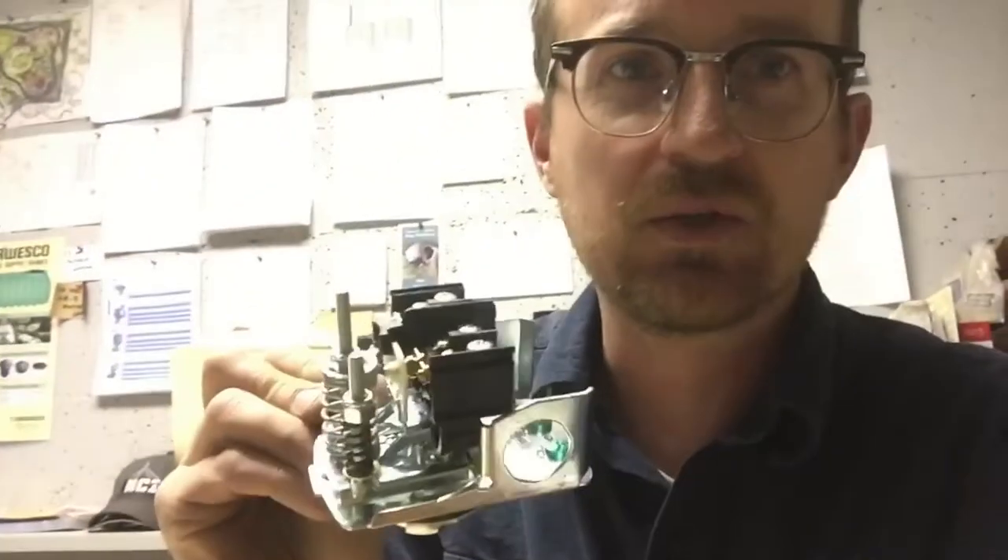I hope this has been helpful and thank you so much for watching. I almost forgot to note — make sure before you work on any pressure switch or the pump to cut off the power supply to the pump. Either turn it off at the breaker or unplug it if your pressure switch is plugged into a wall outlet. Please turn off the power supply and double check it with a multimeter or voltmeter to make sure that there's no power before you start tightening this post here.